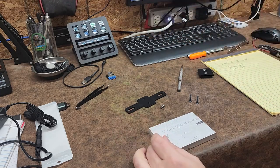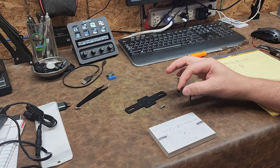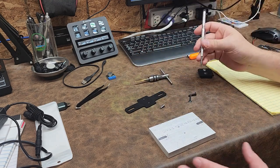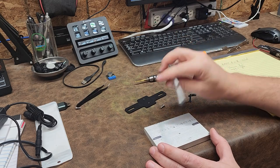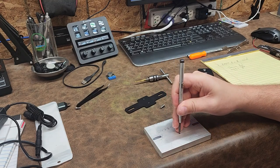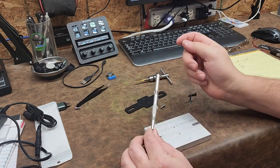It's still functional — lovely. So here is the fastener I'm going to use: these are stainless steel M4 by 0.7, so that means I need an M4 by 0.7 tap. Once I have my two inked sections on the aluminum block, I'm going to take an automatic center punch and put it as close as possible to the center of the inked area.